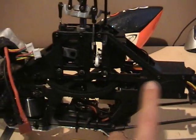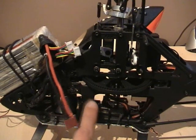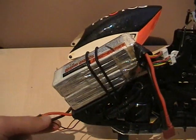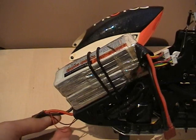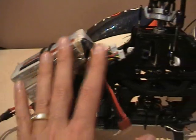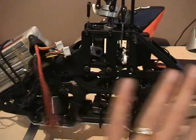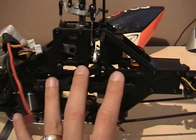I went one further and actually grounded it out to the motor mount, and then grounded that wire out to the speed controller on the negative side. That makes sure that the negative plane — the ground plane — has even potential, so that basically it has nowhere to arc out to.